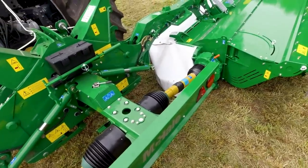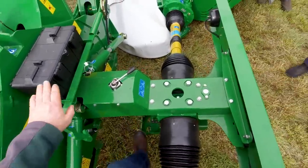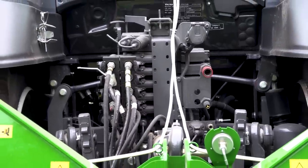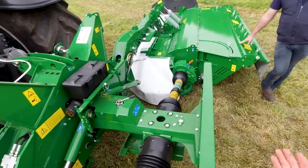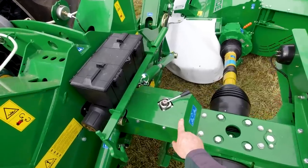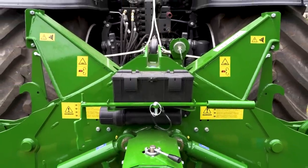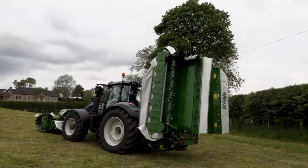They want it very simple for putting on and off the tractor. The beauty of this machine is the parking stands underneath — by simply pressing your foot, they go down onto the ground. The mower can be parked vertically folded up or completely folded down. From a hydraulic point of view, we need three double-acting spools, so any tractor with three double-acting spools can operate the mowers. You've got individual lift left to right, telescopic arm in and out. When the mowers fold up, they go past 90 degrees to keep the maximum width within the tractor going down the road.